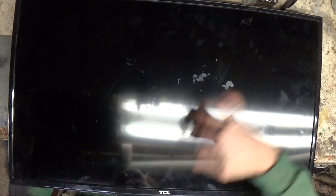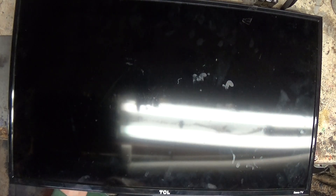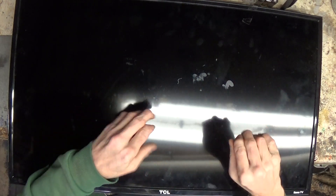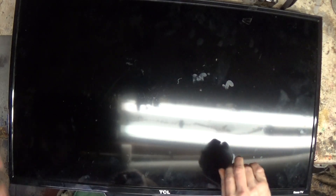So here's what we got — we're drawing 13 watts. Power it back down, try that again. Power off. Back on — maybe I gotta hold it longer. Try one more time: it's off, turn it on, it's dead. 0.0 watts, now 5.3 watts, and we do have a little light down here. That's just running a simple little tiny power supply that's sitting there all the time, waiting for a signal to kick in — when it senses a signal through the infrared, it flips the relay and kicks on the main power.